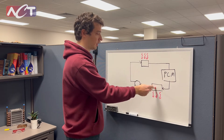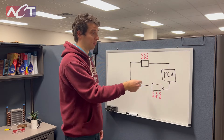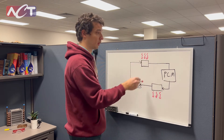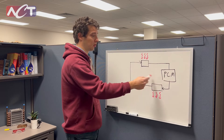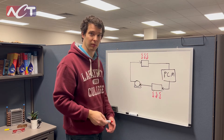The chiller — the cooling system here — will have a lower load on it over time, because basically once the laser turns off, the PCM will then start dumping a little bit of its stored heat back into the coolant system to re-freeze the PCM.